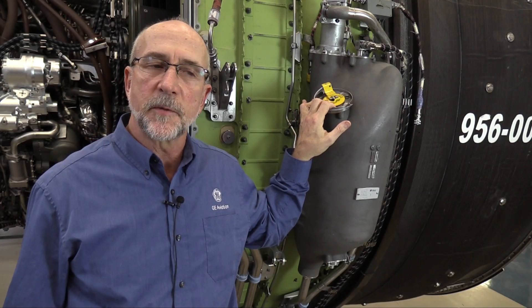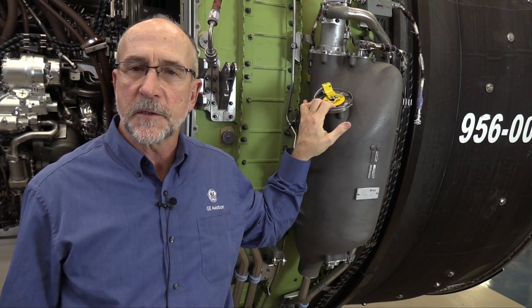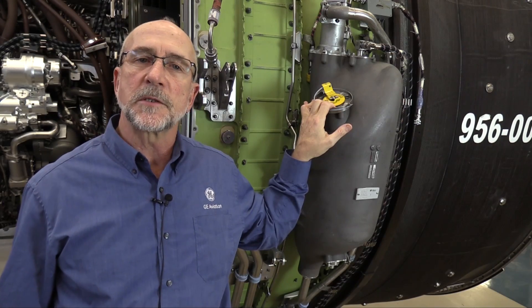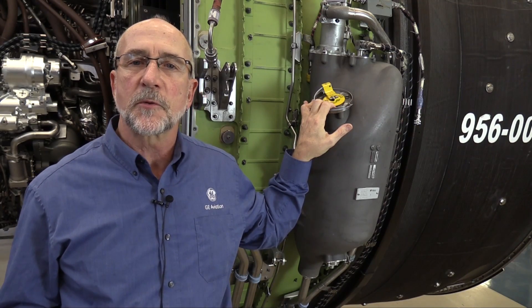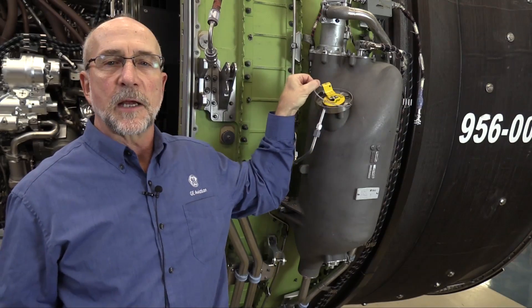That's the GEnX oil servicing system. Remember it will take some time for the system to bleed down pressure so that you can open the cap — five to ten minutes should be sufficient, don't wait more than 20 minutes. Take your time putting in the first quart of oil, and remember to be careful with the lanyard and the latch when going back together. Thanks for all you do to keep the GEnX flying.